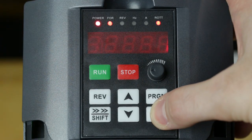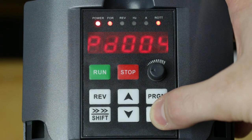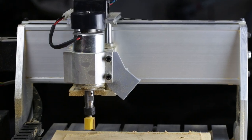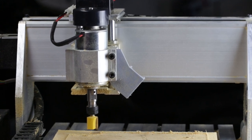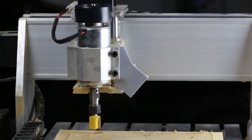I made a video showing how to set up the new spindle and VFD and I'll put a card for that here. Just before it failed I was in the process of facing a new spoil board. I was using a 3/4 inch router bit feeding at 50 inches per minute with a 0.020 inch depth of cut on the worst side of the board.